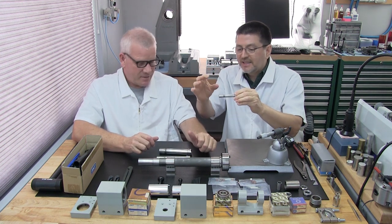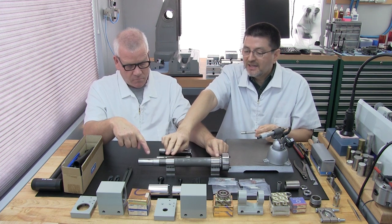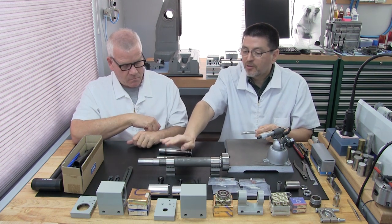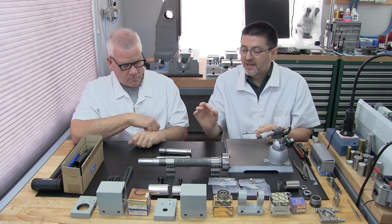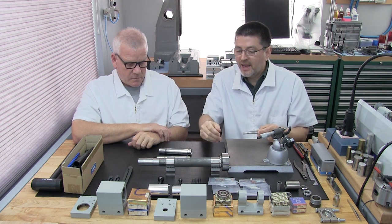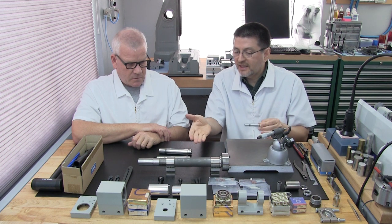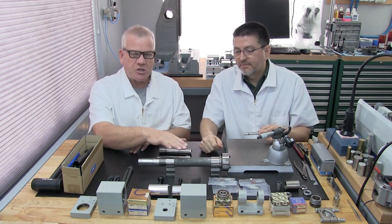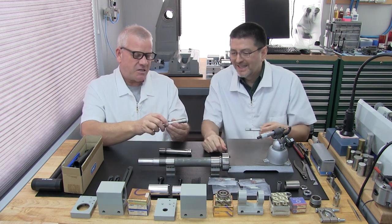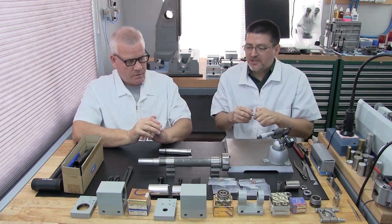It's just easier. Where Lance is pointing out here, you can see it's very easy to identify the bearing journals. It's the area on the spindle that they grind to specification, and that's where the bearing seats get installed and live. There's no reason to grind the center area because nothing gets installed right here. This is the most common style of spindle when you're doing bearings. Not these 11s. This is just an isolated case because they're too small. So I just wanted to show that to you.